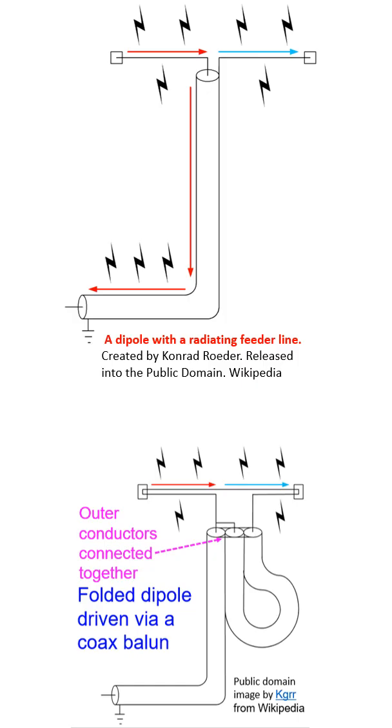When calculating the length of the coax, the velocity factor has to be considered for determining the half wavelength of coax to be used. In the diagram, the half wavelength of coax balun is kept folded in a U shape manner near the feed point. The shields of both ends of the coax balun and that of the feed line are connected together. The inner conductor of one end of the coax balun is connected to the inner conductor of the feed line and to one end of the folded dipole, while the inner conductor of the other end of the coax balun is connected to the other end of the folded dipole.